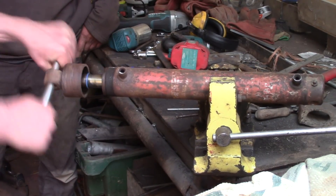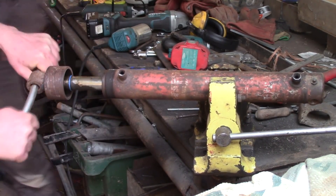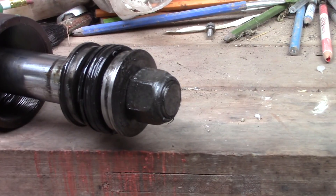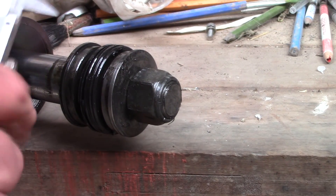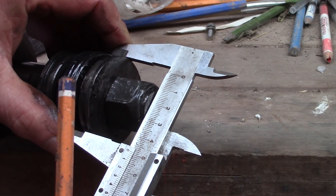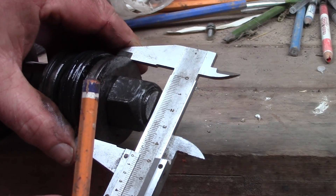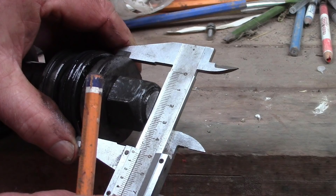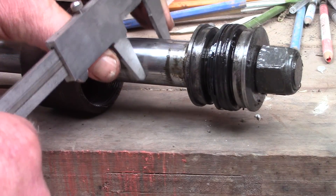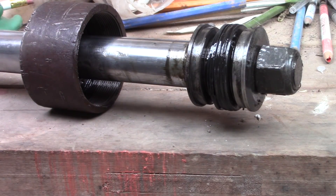Lots of you suggested I should use both strokes of the piston — pushed in as well as out — and that makes sense up to a point. I'd need another set of valves and another pair of cams, which would be okay, but these cylinders are so narrow that the piston rod itself takes up a large proportion of the moving area. When air pushes on one side there's around three and a half square inches, but on the other side the piston rod takes up one and a half square inches, leaving only two square inches.